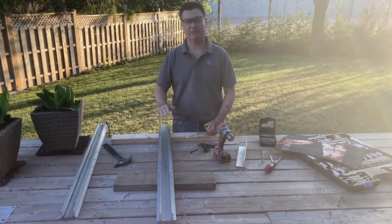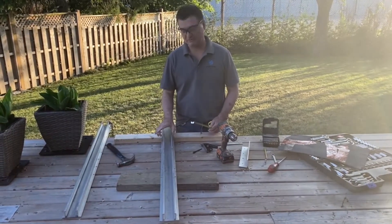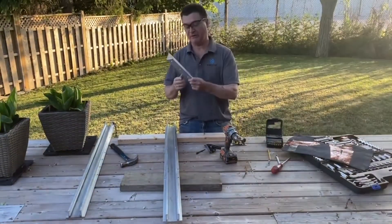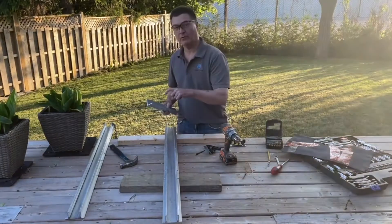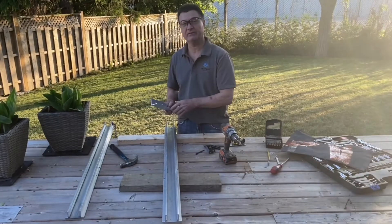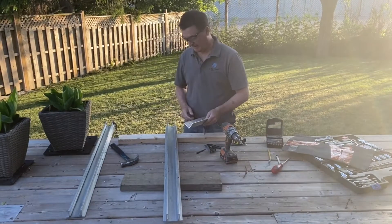Today I'm going to show how to modify the Kaya arm mast to accommodate 48 inches from the top of your dock down to the top of your water. To do this, I need to drill two additional holes for the mounting brackets and two holes for the screws that mount horizontally into the dock to keep the mast from moving.